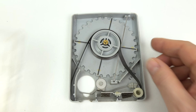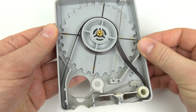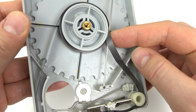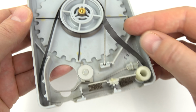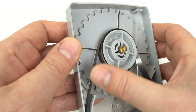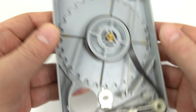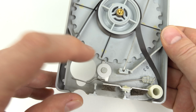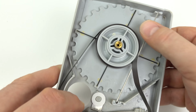Let's have a look what's inside one of these cartridges. Well, obviously we've got the tape in the middle there. It's only a small amount of tape on this one. I think it's a 70-second loop. So it goes from the inside around the bottom and then back on the outside of the reel again. Now, this tape is locked in place. There's little teeth there you can see which are holding it, but when you push this bar, it releases it, so I can spin it around now.